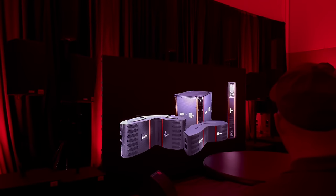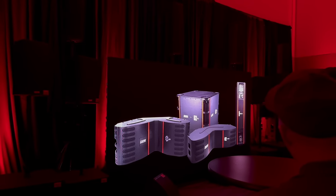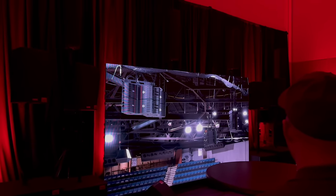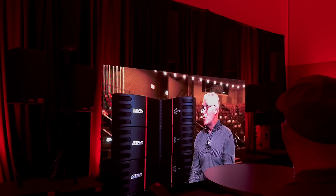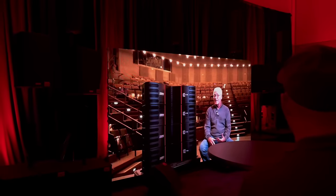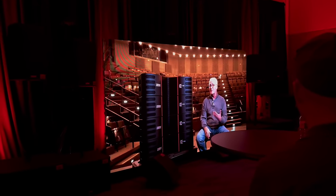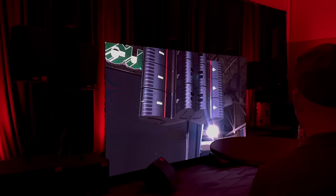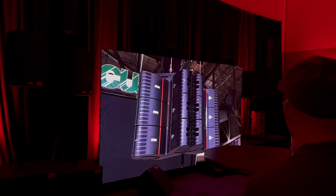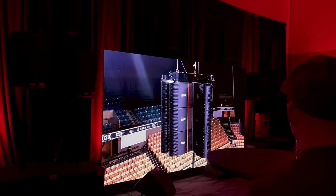With the adaptive technology, you don't have to rely on a long vertical line to cover a long vertical geometry. You can fly much shorter arrays and still have the same output capabilities of a normal long articulated array, right? That's probably adaptive's calling card there. In addition to that, because of the way the adaptive arrays are designed, the ability to expand horizontal is very easy. I mean, it's all built into the arrayability of that array. You just buckle up another 70, 80, 100 degrees of coverage into any array that you want to do.